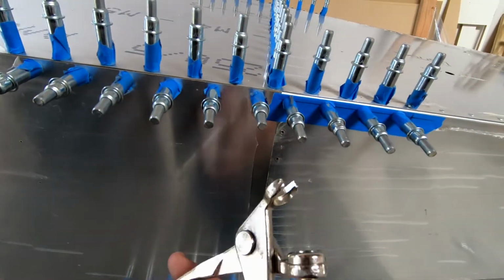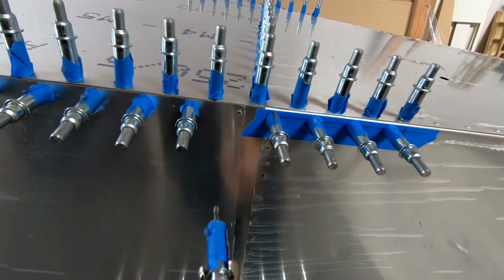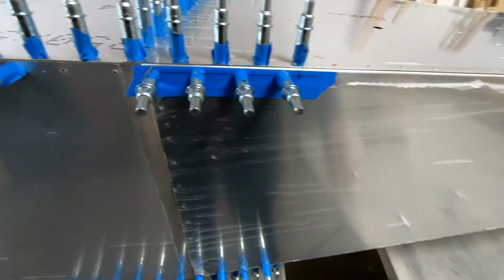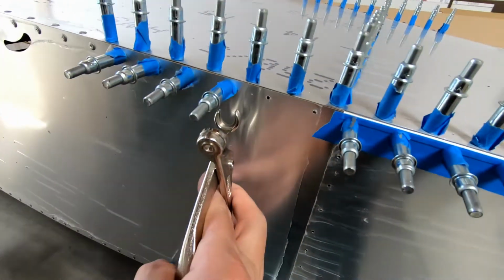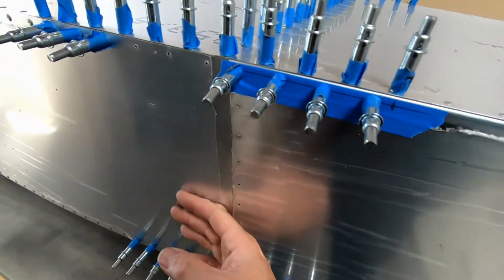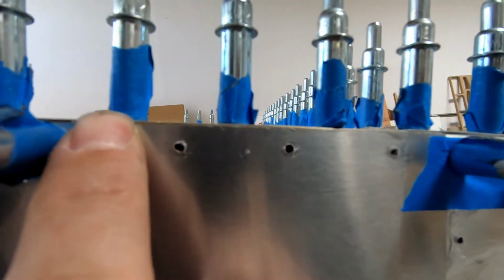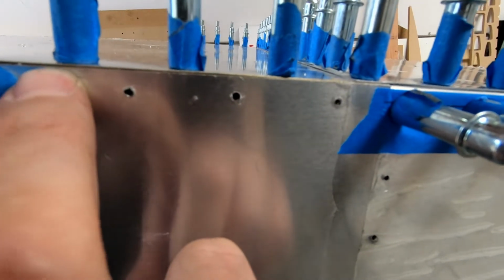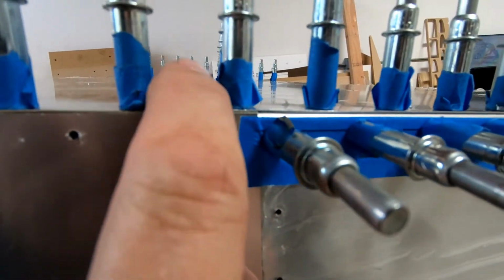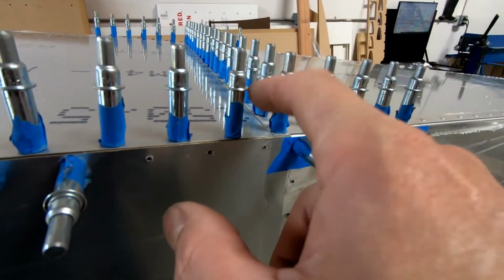Now watch what happens here. If I just simply pull this sheet metal fastener out, this one out, you can see how much of it's already fixed already. If I pull this one out, it basically completely goes flat. And if you look at the skins here, you can see that the skin here is flush with the angle and then starts going up here to where it's almost flush now with the skin. So I've actually got now an overlap between the side skin and the top skin.